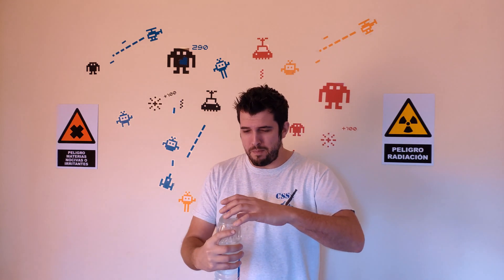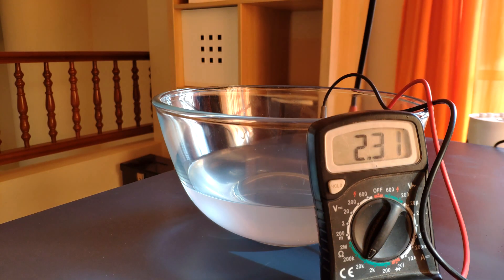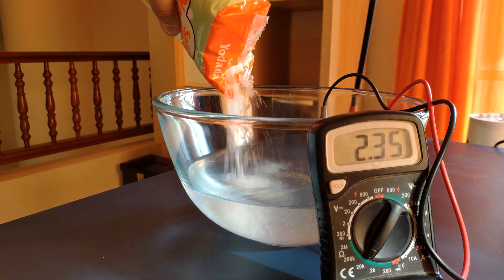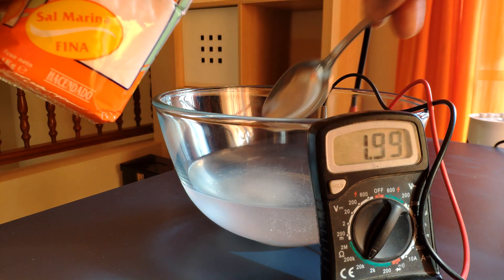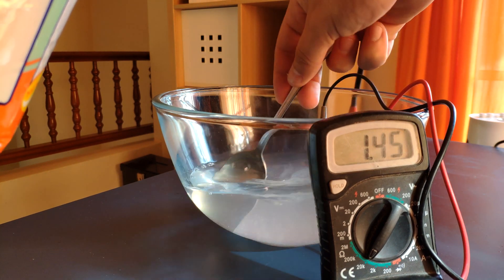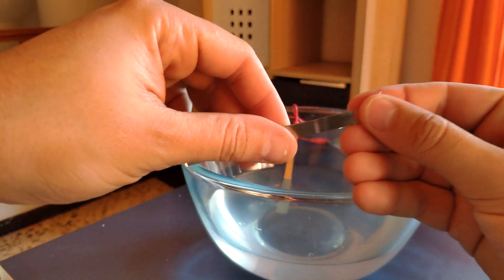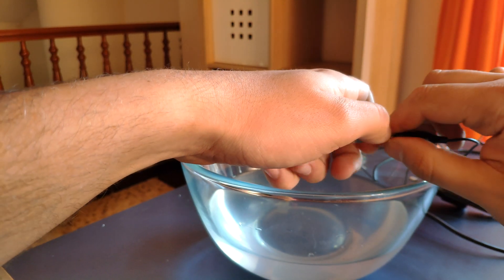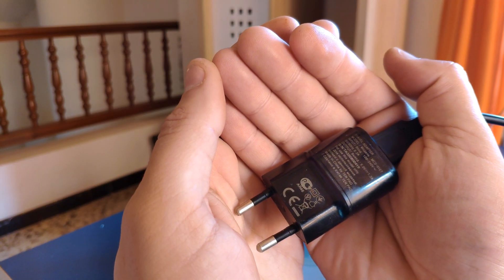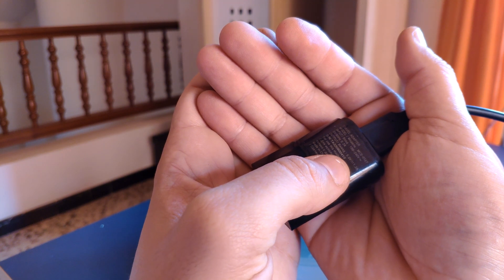It's concentrated, it's very, very strong. We are going to add some salt to the vinegar to increase its conductivity. I'm going to use this nickel plate that I bought on AliExpress and attach it to one side of the electrode. As a power supply for the electrolysis, I'm using a mobile charger that works at 5 volts and 1.2 amps.